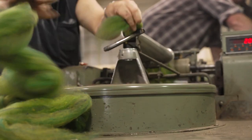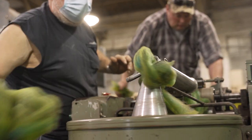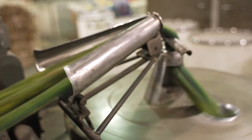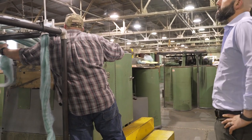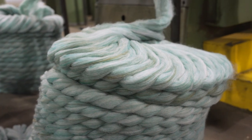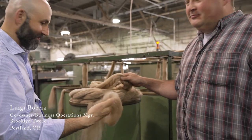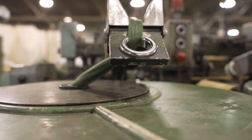The next step after blending is moving over to the card. We feed the blended material into the back of our feeder, which takes those colors and keeps them nice and loosely apart, feeding them into the machine. As the fibers proceed on the belt, they go from being in every direction to — through a process of rolls and hooks — being organized into more and more parallel arrangements. The easiest way to describe that is waking up with bedhead and hitting it with a brush first thing in the morning.